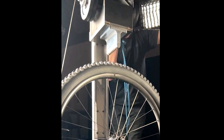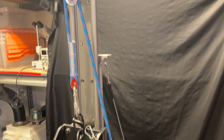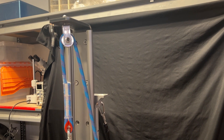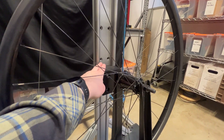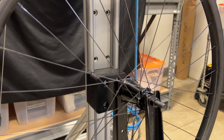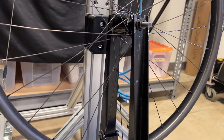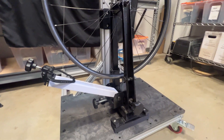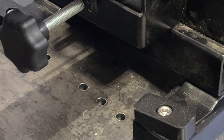The whole linear rail is adjustable up and down so we can move it around and do things like fit it through doorways. We also have this bottom-out bumper here, which I've never had to use, but in the worst-case scenario, if we completely destroy a rim and the impact sled keeps going, we have this sacrificial 3D-printed bumper that will break and is bolted to the rear support, so it hopefully slows the thing down and doesn't ruin the whole machine.